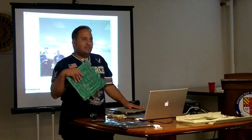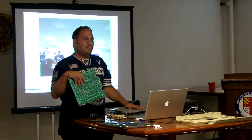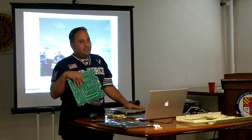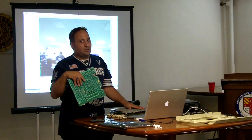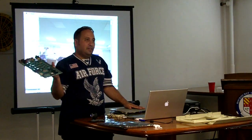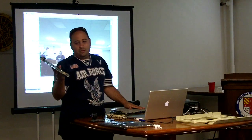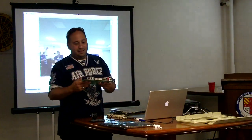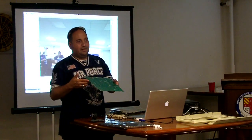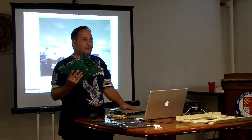Another thing, I think a lot of the Apple II model numbers on Wikipedia have finally been entered. People have put them on there. You can go look at the 2Cs, A2S 4000, and there was 4100, 4020, I think, for the later revisions. Motherboards need to match the model numbers with the ROM numbers. All this, looking at date codes, comparing stuff, looking for solder globs on the back. Are you getting something that's been pieced together?